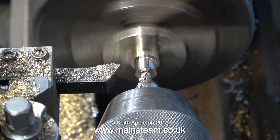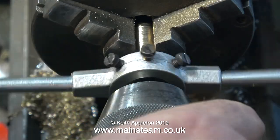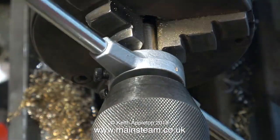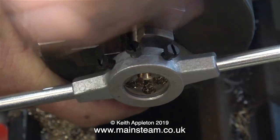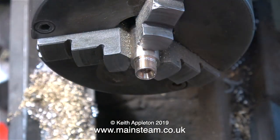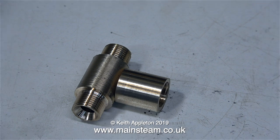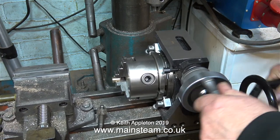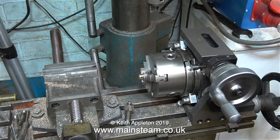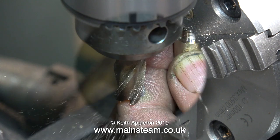This clip shows the end of the bar turned to three-eighths of an inch in diameter. Now I need to center drill the part, but I have to be careful — I need to leave enough material around the edge of the center hole to allow the thread to be cut on it. I'm not using a tailstock die holder for this; I'm using a standard die holder but using the tailstock chuck to make sure the die is square to the work. Here's the finished 3/8 by 32 threads per inch thread, and when I screw a union nut on it, it's perfect. I didn't bother showing the threading of the other end because the process is absolutely identical. I now have a kit of parts. I need to machine the end of the fitting that's going to hold the water tap, and for this I'm using my rotary table mounted on its side, rotating it so the open jaws are at the top so the chuck does not collide with the jaws. Yes, I know I should be using a milling chuck, but I use this one because it never drops cutters.